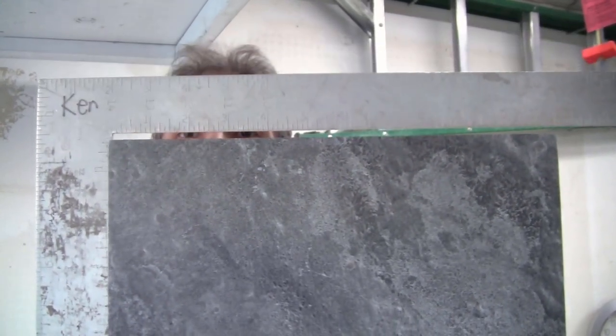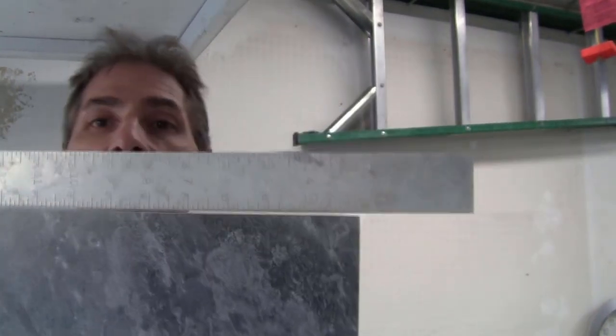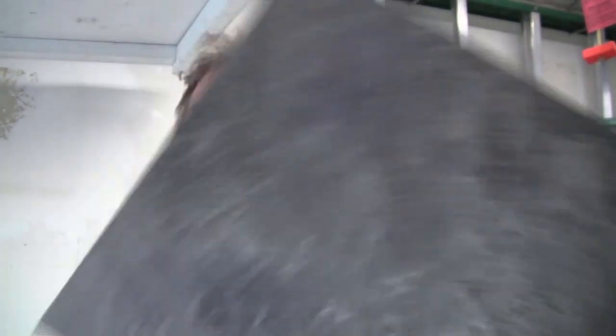Because I wasn't dead on and didn't own a belt sander — I'm just a DIYer, not a professional laminate person — I tried to use my router to get it straight, and it just was a hell of a time and took off a boatload of material. But I was able to get it good enough. I've verified all four edges are really clean. I have my framing square here, and I was able to take it and bring it down to the project like this. It's not perfect — you can see a gap right there — but it's close enough that I'm going to move forward with putting the bullnose on. Let's get started.